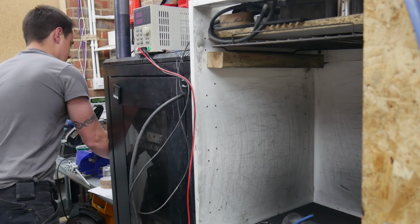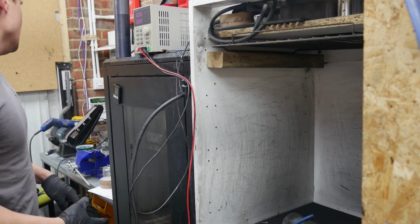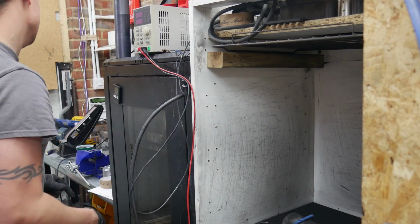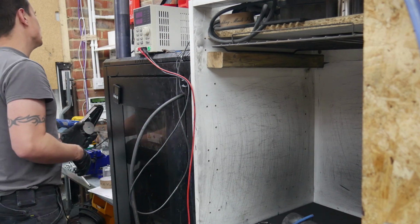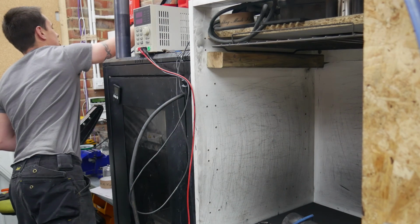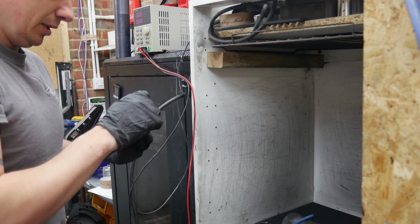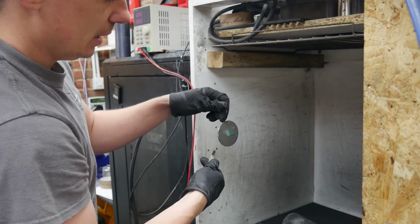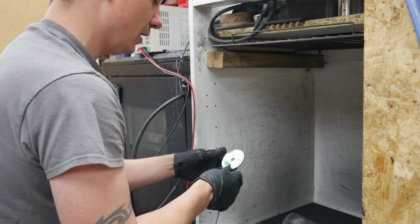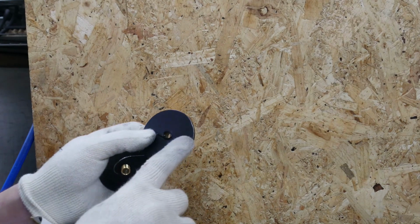The downside of that is that you don't have any control over how much static you're putting in. The more power you put into the gun, the higher the voltage, you can get into deeper corners that generate what's called a Faraday effect. I can't do that with this gun because it doesn't have any adjustment, it's just one thing. And to be honest, the gun works fine for us. So the 3 bases that we powder coated, I'm not happy with.